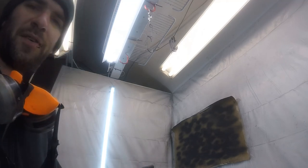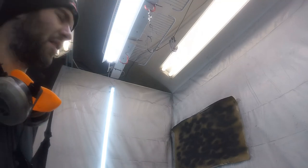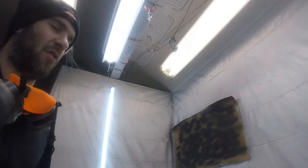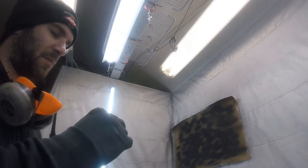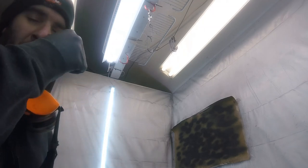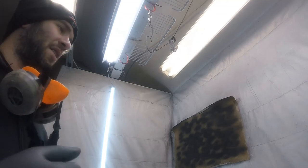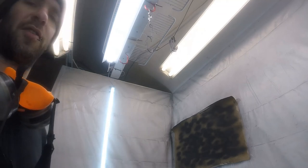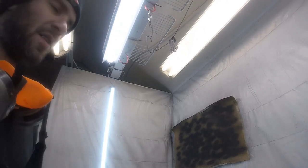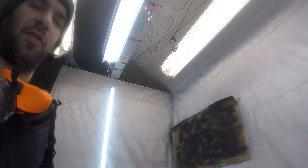It's right up front with all the roots and everything, especially going into the expert class, who knows what they'll look like. The stuff's super strong, don't get me wrong, a very strong coating, probably stronger than powder coat. It's just less susceptible to chipping off. With powder coat, if you hit it with something, it's going to chip that whole area off. With Cerakote, wherever the impact zone is, you might have some damage, but it's a very strong coating.